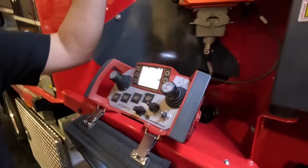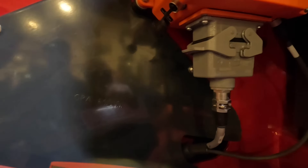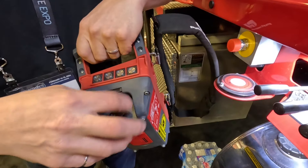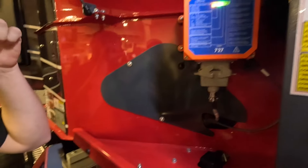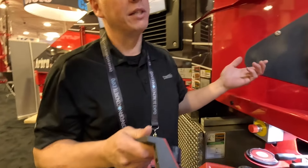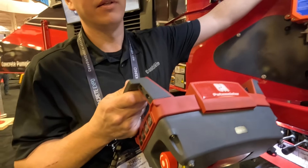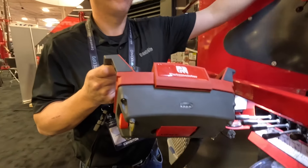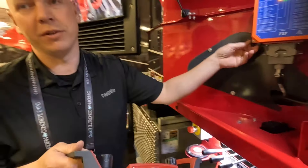On Ergo 2 we had a shark fin antenna that plugged into a port on the side. On Ergo 3, the only purpose for that port is to use a hardwire cable if your battery is dead or you lost your i-log chip. Your antenna is now back to a stubby antenna like the old ZMSK 24. Those shark fin antennas were expensive and would fill with water — now if your antenna fails, you're not dead in the water, just limited to maybe 100 feet of range, and it's a $40 antenna instead of a $1,000 one.